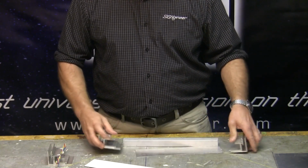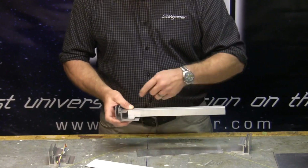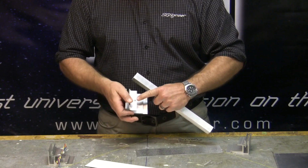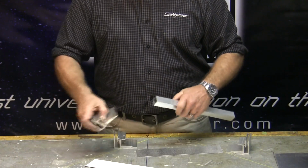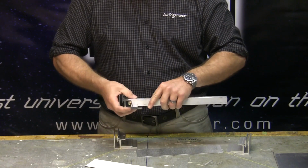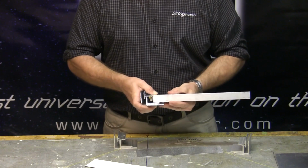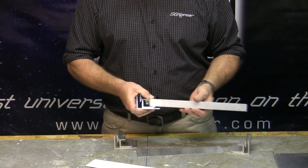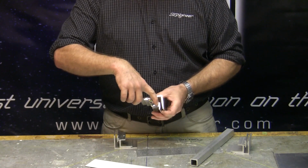This area right here, when you put the 1-inch tube up here, if this is deburred on each side and you have holes drilled on this lip wherever you need the wires to pull, you can actually put this up there with this deburred and the bottom side of these holes deburred. That is UL compliant. One of the other nice features about this, it has a built-in hanger bar right here.